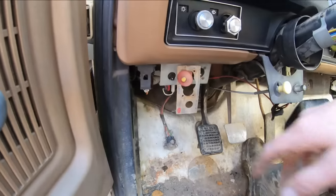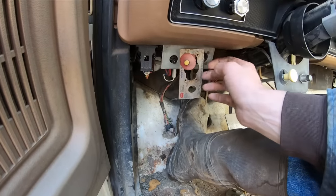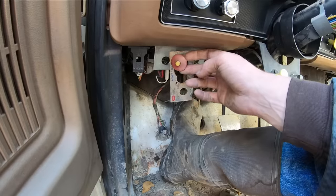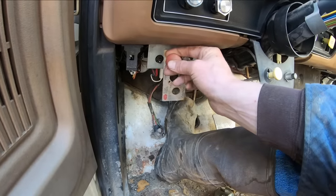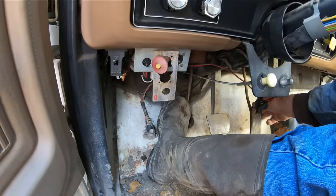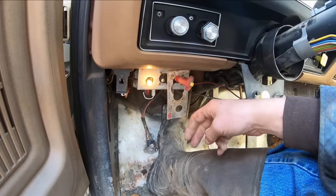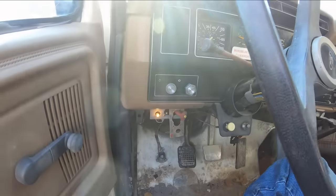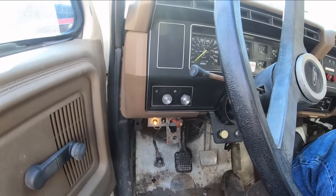here's our PTO switch down here. To engage that, we need to push the clutch. And this is an air-operated PTO, so when I flip the switch, it should engage the gear on the transmission. Hopefully we can hear that. We throttle this thing down. Needs a better return spring. I heard it grind. Did you guys hear it? The light even works. Oh yeah. Give that just a hair more throttle for running the PTO. I heard it engage.